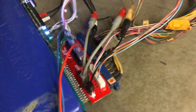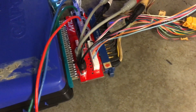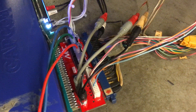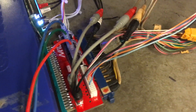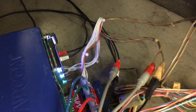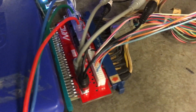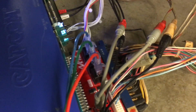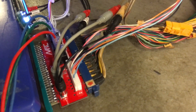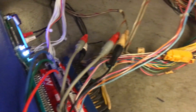This is the Player One side. It is an interstitial JAMA kit, kind of like the Splitfire. JAMA goes to the cabinet, and then JAMA on this side goes to the game board, and then it has a bit of IO in the middle. On the side there is the CPS2 kick and line inputs, where this board plugs into the CPS2 or whatever compatible board you have to provide kick outputs. The board also accepts kick inputs from the cabinet, and also does line audio and spreads that through.